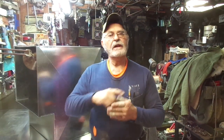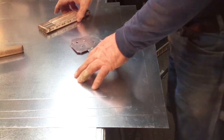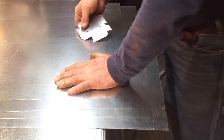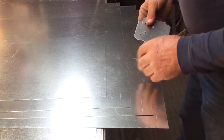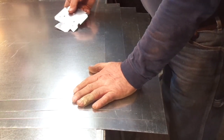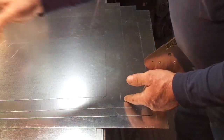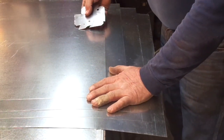This is just another variation of a return air box style. The circumstances dictate the necessity of how you fabricate something or how you lay something out. This will be fully sealed and fully insulated with double Mylar bubble wrap all the way around on the outside, and it's going to be completely covered with batting — I think this one is going to be covered with batt insulation on top of that. I've managed to either delete or record over some of the footage, so in several places throughout this series I lost a little bit of the layout. So I'm just explaining what I did during the layout procedure. This happens to be just a couple sections of flat duct already laid out to dimensions, and I'm getting ready to notch it right now.